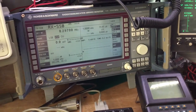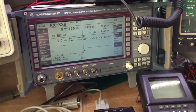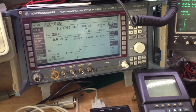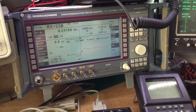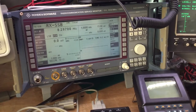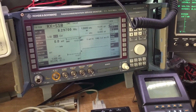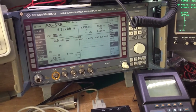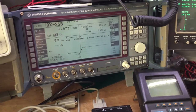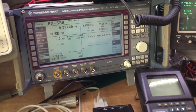With amplitude modulation, or AM, the carrier wave is again produced on the frequency that we wish to transmit on. However, only a proportion of the total output power is transmitted when there is no speech. So if we don't speak into the microphone and we just key the mic up, there'll be about 20 to 30% of the RF power. So for example, on a 30 watt transmitter, if you keyed up the transmitter without speaking into the microphone on an AM radio, there might be somewhere between 10 to 15 watts of RF coming out. But when you modulate into the microphone, you start to speak into it, then the carrier will be amplitude modulated, where the output power of the RF amplifier will be modulated so that it would peak at, say, 100% modulation, for example, which would equal 30 watts if you're using a 30 watt transmitter.